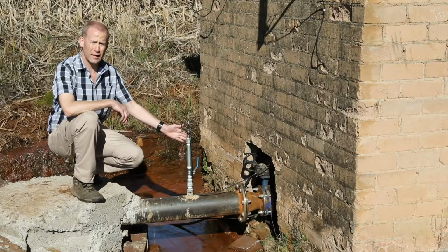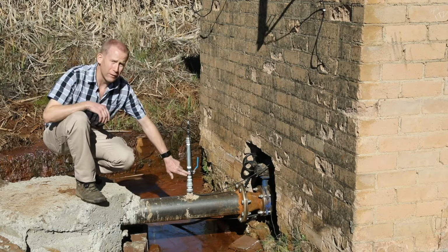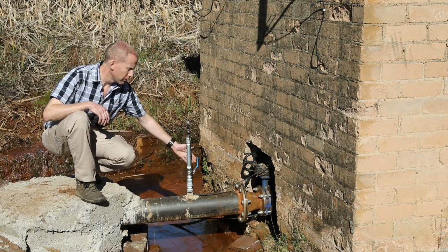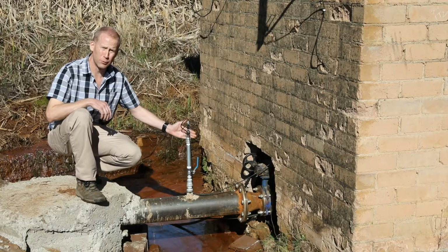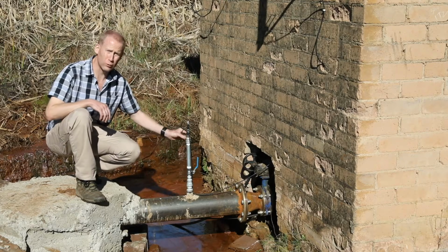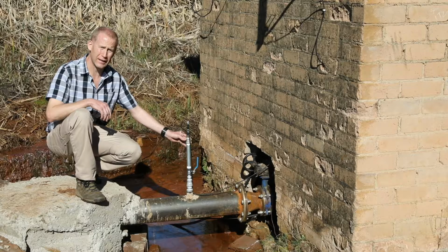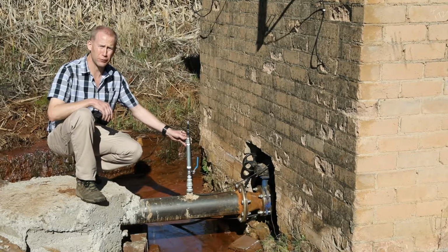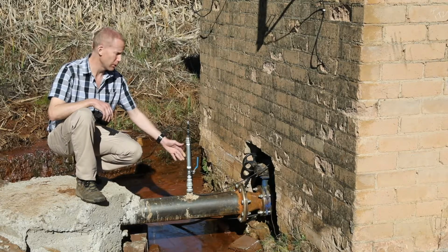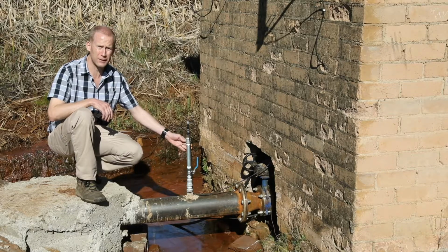This shows the installation of the pump outlet pressure sensor. We've installed an isolation valve so you can close the valve and remove the sensor without having to drain the entire pipeline. We've also installed a small standpipe. The idea of this is that it traps a small amount of air in this section of pipe, so if you do encounter freezing conditions, you do not end up with any water inside the sensor, which then freezes and